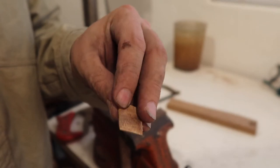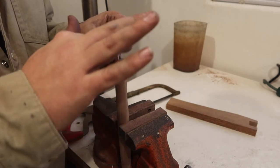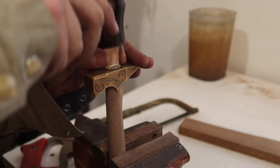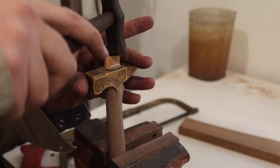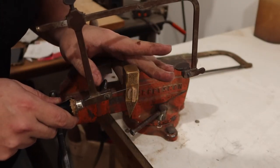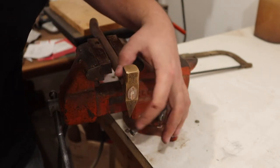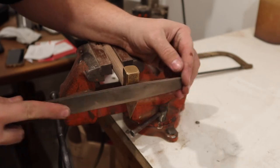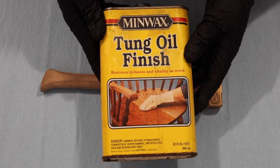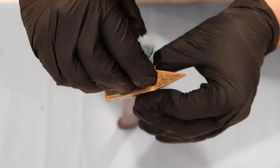The wedge I made out of a little piece of hickory, and it'll have a nice contrast against the dark walnut. I'm going to use a drop of Titebond original to keep it from working its way back out. And of course our favorite wood finish — tung oil. Man, you can really see that wedge pop.